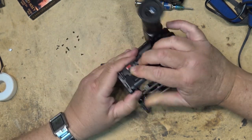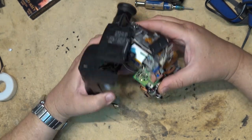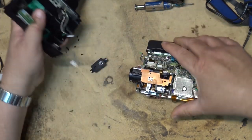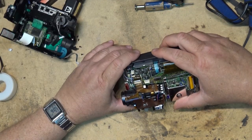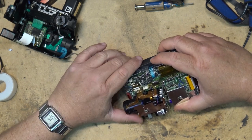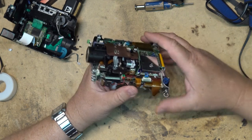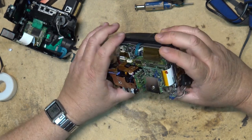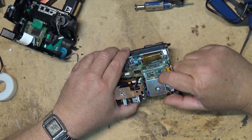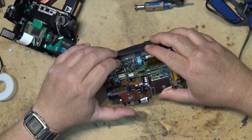We'll just take this apart so you guys can see what's in one of these little cameras. Pop out that connector on the bottom and there's the viewfinder. Check that cap — that's usually one of the ones that goes bad. The camera section was actually putting out a picture. The DC-to-DC converter is here, and again there are surface-mounted caps — there's one there.